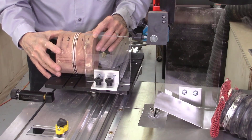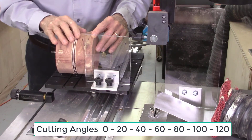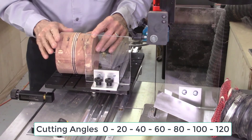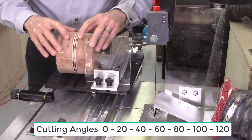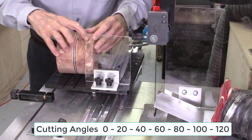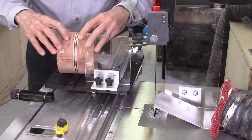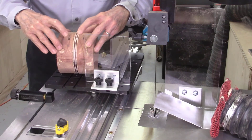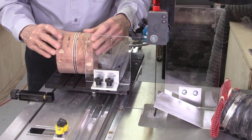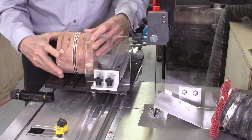I'm doing things a little bit differently for this next clock. I'm not using a 90-degree cut at all. I'm going to use 20, 40, 60, 80, 110, and 120 degrees, so I'll get two bevels on the front edge. I want my 80-degree cut to be my angle cut that rests on the table — so that one's a little bit wider. I mark the width of my various facets — they're about 0.65 inches apart, with the center one where it rests on the desk at 80 degrees being a little over an inch wide, and the two front bevels each about half an inch wide. I'll use the laser beam to line up these positions. I'm also cutting using a 16-position disc but only doing 8 facets — skipping every other step.